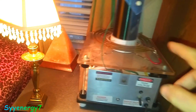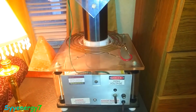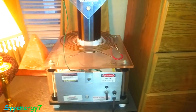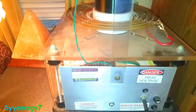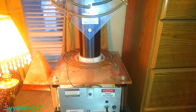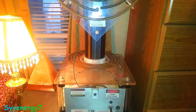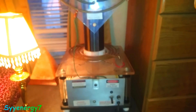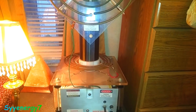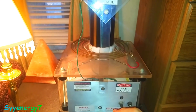In the back there's a couple of tungsten rods — you adjust the spark gap for the Tesla coil. Normally they say set it at an eighth of an inch, and as the tungsten rods get consumed — I have extra ones — you adjust the spark gap. But somebody told me to set the coil at a sixteenth of an inch and it runs a lot quieter. I tried that out, I just turned it on and it is quieter. I'm probably going to use it a lot more often now because it's not scaring my cats.